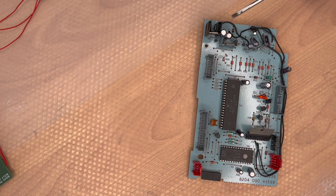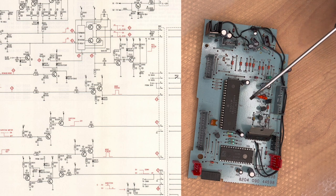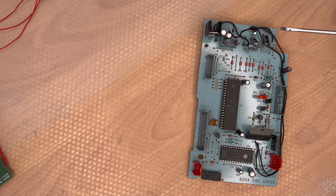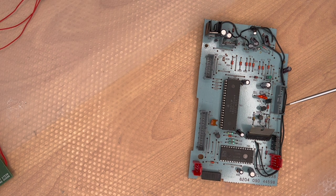I put a cooler on the power converter — I was using a 7806 for that. We can see a lot of diodes, circuits to control the tape mechanics, and the driver for the motor. There's also a crystal running at about 6 MHz, which is the clock for the CD player microcontroller through a transistor. There are a lot of connectors because this board controls basically everything — it's the heart of the machine. One connector goes to the tape mechanism for controlling and switching the capstan motors and relays, and another carries sensor signals: photo transistor, LED, and all the switches.